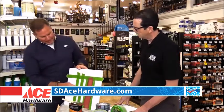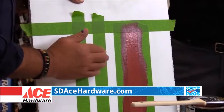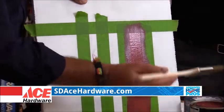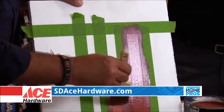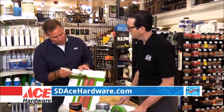So when you're putting any kind of painter's tape on — whether you're going around trim or you're going to create some stripes on a wall — the trick is when you apply it to then use your finger to set it. Because the whole idea is that when you apply that paint and you're creating those lines, if you don't set it, when you peel the tape, you're going to get what they call bleed-through.